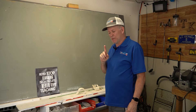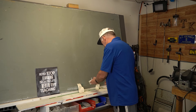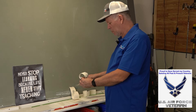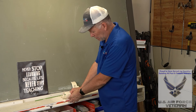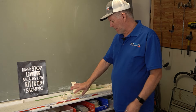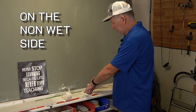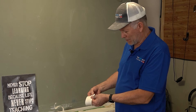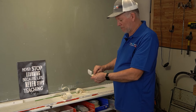One more thing to point out: on the back side of some tape pieces, there's no mud, while on others there is. That actually shows it didn't stick as well. When I gently pulled these up to check, the mud came off the not-wet pieces fine, but when pulling the wet pieces, it felt like it wasn't going to come loose without tearing the tape — and you can see it delaminating right there. On both not-wet pieces, it is stuck better.